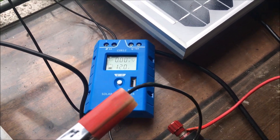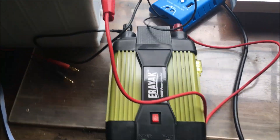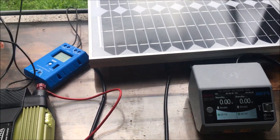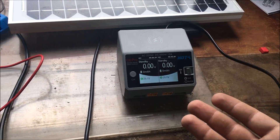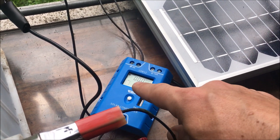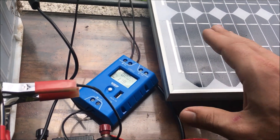I'm going to plug in the charger here and see where the voltage jumps. The wires are running down and over. We've dropped to 12 volts with nothing running on it yet. On a bright day it might not drop at all. We're going to hook up a battery, start charging, and see how low it gets — or maybe it only drops another point and stays steady. The sun is really trying to come out.